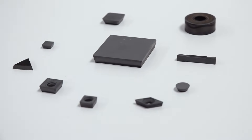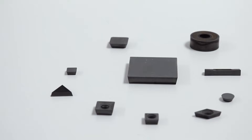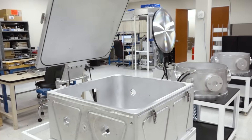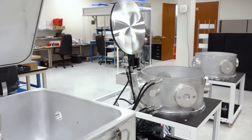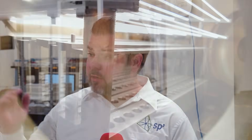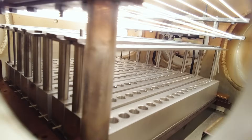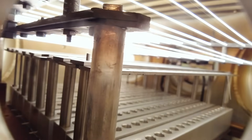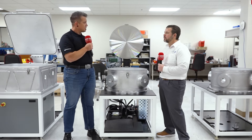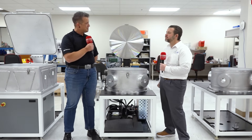How big are your units right now? In this machine we can coat substrates up to about 12 inch by 12 inch, which can be hundreds of tools or inserts, or maybe just one part if it's really big. We're also working on developing a new chamber, the 975, that will coat up to 450 millimeter or 18 inch parts — so about 50 percent more capacity.